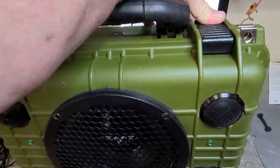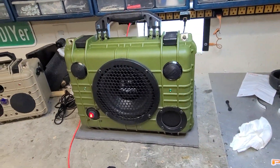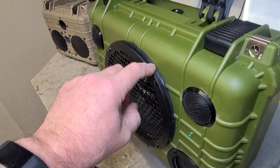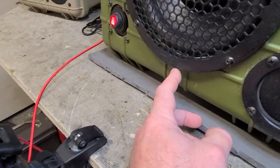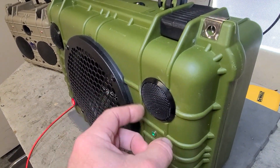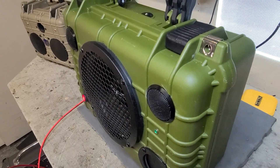It took a long time to get this thing situated and making sound. This grill has no slap — I used an 8-inch O-ring embedded inside this steel grill. It's a DS-18 grill that I just bed-lined. The tweeters are screwed in — I just cut a 2-inch hole and screwed them in, making sure everything was good and sealed.